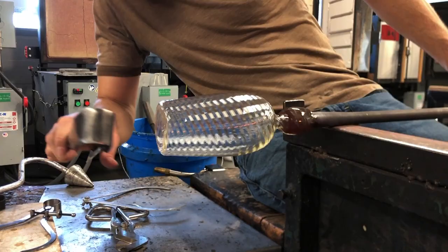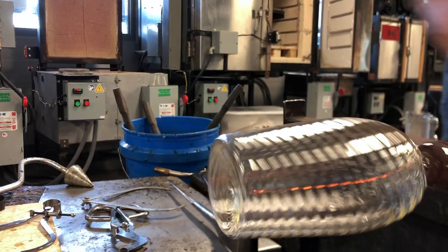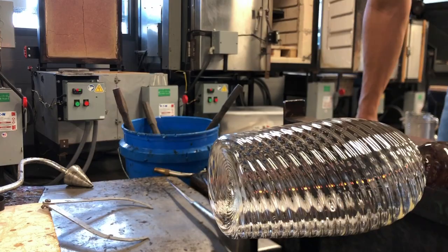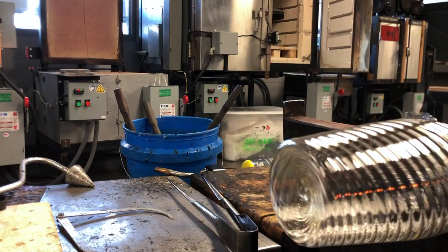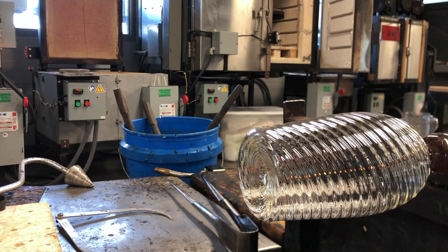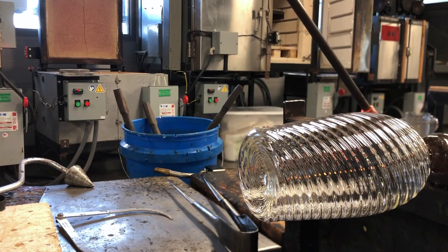You don't want the bottom too hot. If you just punty right away with these cups with the bottom super hot, you're going to have a hot bottom and a hot punty — and most of the time people have the problem where they can't get it off the punty without using water and end up with a nasty punty mark. So I'm making a punty — you know what it looks like. I'm letting the piece sit there. It sags just a little but there's still a little red color up on the blowpipe telling me we're still hot. Much higher angle this time, much less touching, one time around. That punty looks a lot better — it's got a nice sharp connection to the bottom and a nice red-orange glow to it.